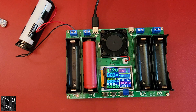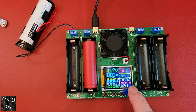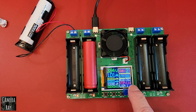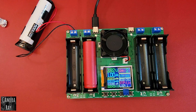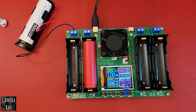I set the stop voltage to where I want it — I store batteries at around 3.6V or even 3.2V sometimes. Once you put it to discharge and set the stop voltage to 3.2V, that's as low as it'll discharge to. I've set the discharge stop voltage, and then I just hit this third button and it'll start discharging. It's showing it's discharging and it'll discharge the battery at up to one amp — that's automatic and you can't adjust it. For smaller batteries it's usually 0.5 amps or lower.